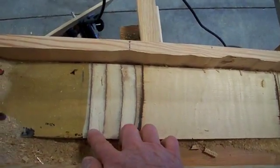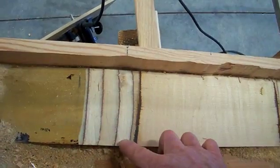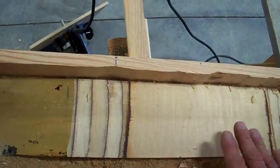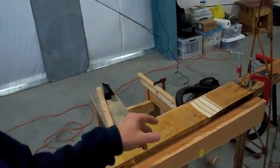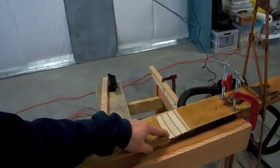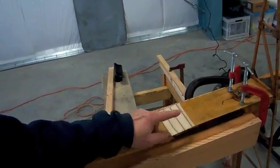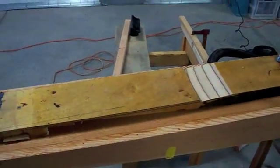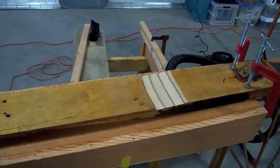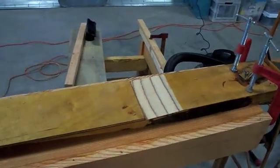You can see I'm pretty straight on my cuts here, about 90 degrees off the spar, maybe a little curve in here so there might be a little variation. I've flipped my spar router box over and cut a 15 to 1 slope into my doubler, and when I go to bond my two spar halves together, I'll run my gusset up here and use this as my ramp to bond that.